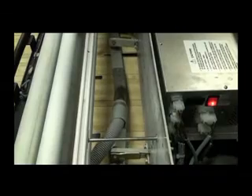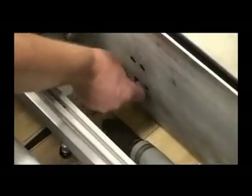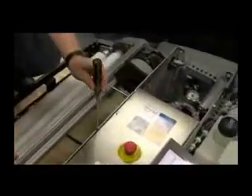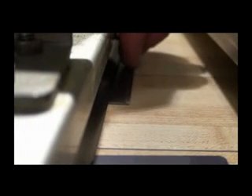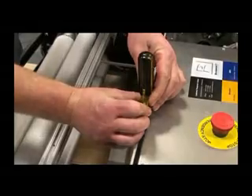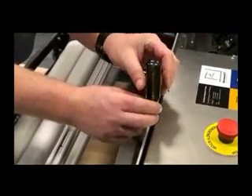Raise the squeegee to the up position. Loosen the four flat-head screws that mount the squeegee lifting motor assembly. Remove the buffer brush adjustment tool and insert the 11-inch Phillips screwdriver until it is aligned with the adjustment screw. If the squeegee has less than 30 degrees of contact with the lane surface, turn the screwdriver clockwise to increase the squeegee contact. If the squeegee has more than 60 degrees of contact, turn the screwdriver counter-clockwise to decrease the squeegee contact. Repeat the process until the proper adjustment is achieved.